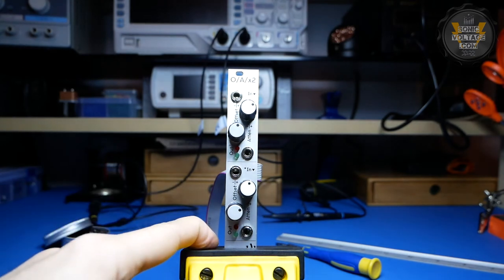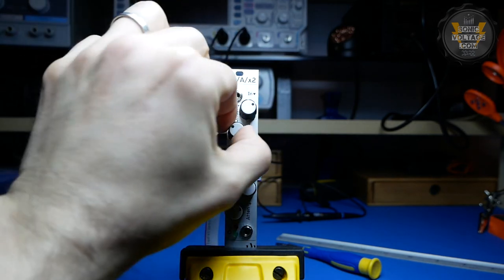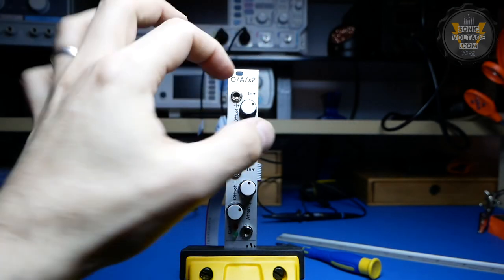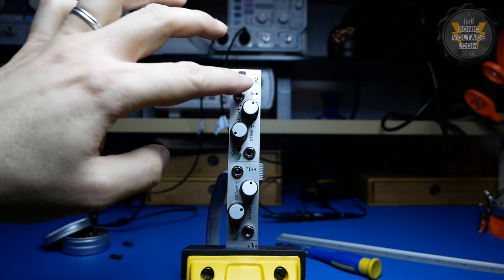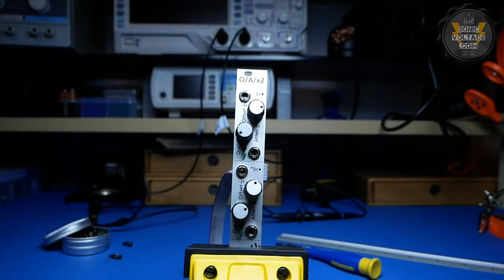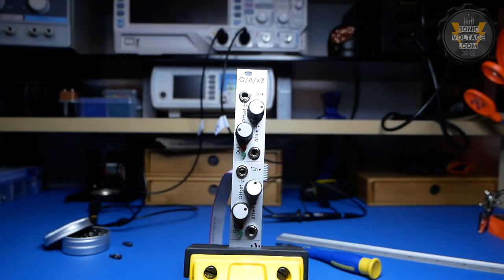This is with the other modules. The ALM010 instead always gives you a separate control over the DC offset. It's two separate knobs, one for attenuation, inversion, and a little bit of extra boost with the AC voltage, and a separate function of DC offset plus minus 10 volts. So even if I have something plugged in, if I want to add an offset to the output, I can. With some of the other modules, you can't. It's either attenuation, inversion, or DC offset. Again, there are compromises. This is only 2 channels. Others may give you 3 or up to 8 channels. So it always depends on what you need.